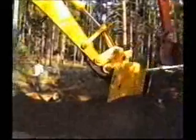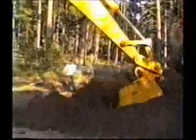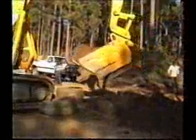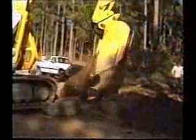While primarily used to backfill spoil behind a trench box, compactor buckets can be equipped with optional shanks and teeth. When hooking up houses to existing sewer lines, the compaction bucket so equipped will allow the contractor to dig, backfill, and compact with only one tool.